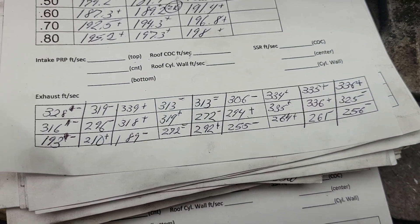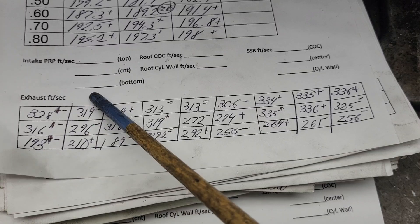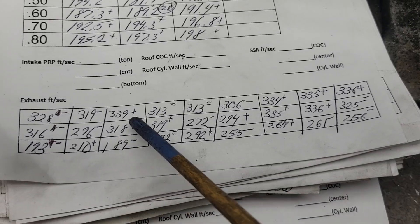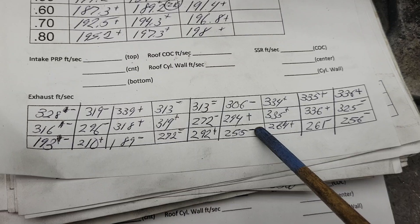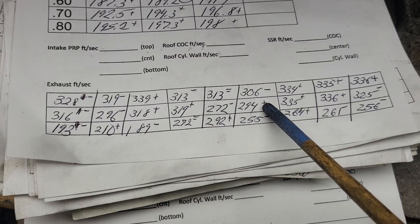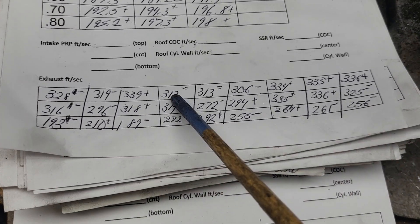In reality, our airspeeds aren't quite as good as my go-to number — 86 and change. We're going in reference to this row. A lot more action on the top, took some away from the bottom, a little bit more activity right in the middle, which is good. But notice we're 339, 306, 336 — we dip right in the center. I would like it a little more even.